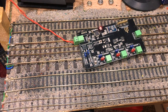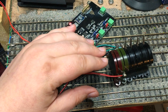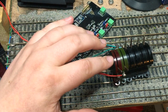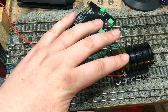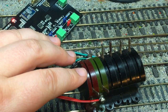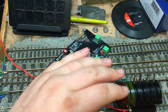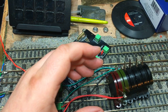What I actually want to do is try three different switches just to see how they work. For this, I'm using some old Hornby 00 switches. These were new in the 1950s, and it just shows how versatile the ESP is that something as old as this, designed and made many, many decades before this was even conceived, can nonetheless still be perfectly functional and usable with it. The maroon switch is a D1 type switch, which is a passing contact. That means that as you move the lever, in its resting position it's completely isolated, and there's just a momentary pulse of power as we move that lever across and back again. These were designed for use with solenoid type points so that you just got that initial pulse to change the point, but it wasn't powering the coils at all times.